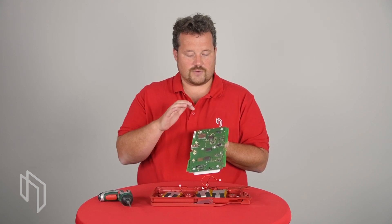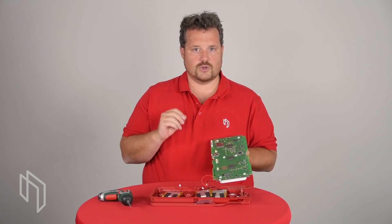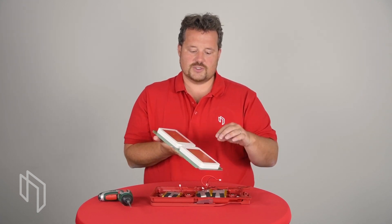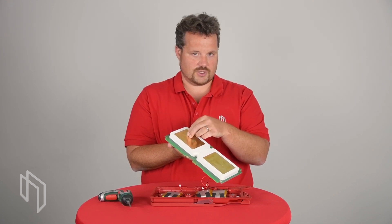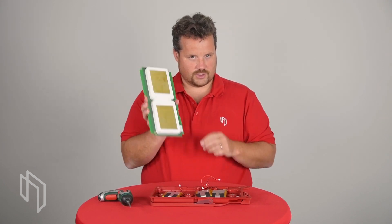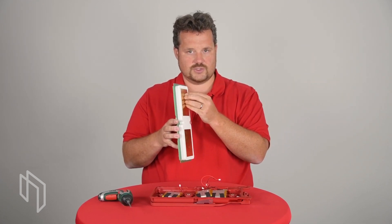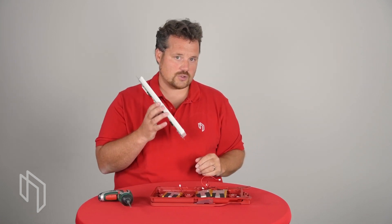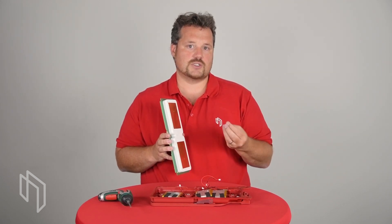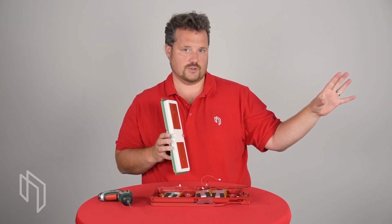On the other hand, we have what's called carrier cancellation, which works a little bit like the noise cancellation you might know from headphones — it actively cancels out the signal transmitted from the sending antenna to the receiving antenna. And this is not only direct crosstalk within the box; it's also crosstalk from the sending antenna reflecting off objects in front of the antenna back to the receiving antenna. So it's a dynamic situation — the box must always keep track of what's going on around it and continuously cancel out unwanted signals so it can hear the transponders.